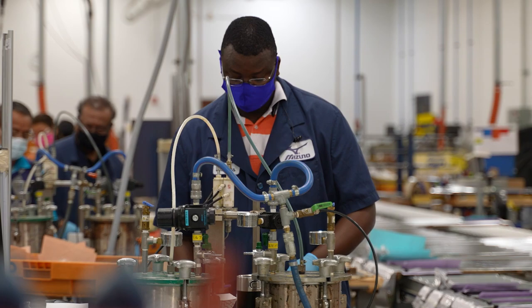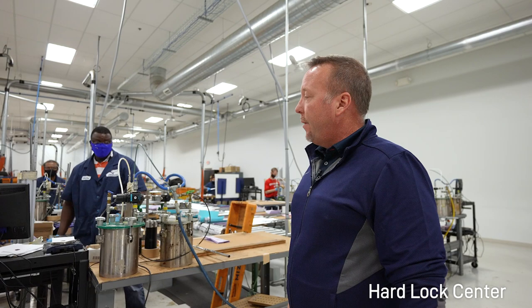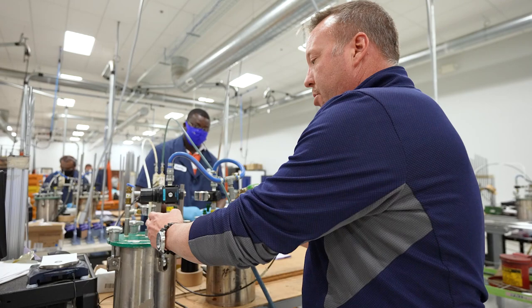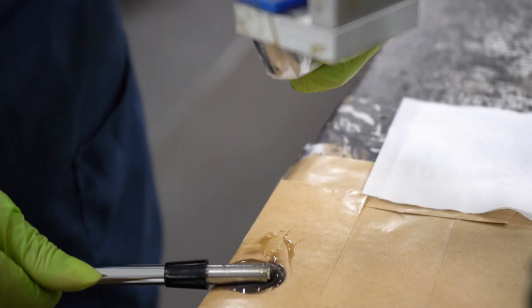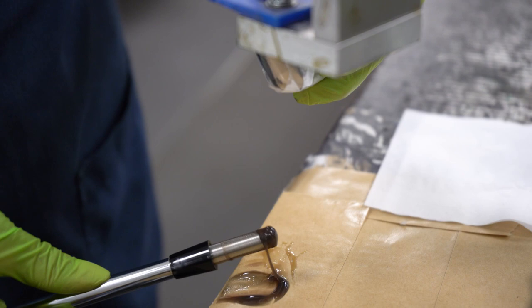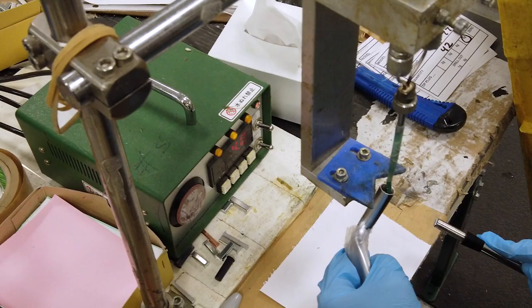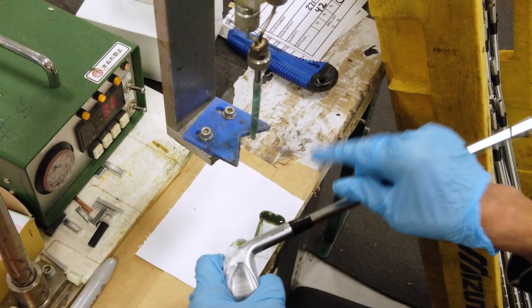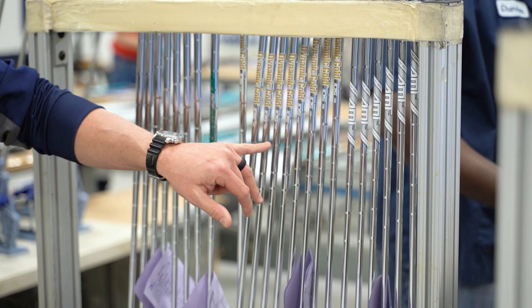Welcome to our Hard Lock Work Center. Charles is in the process of gluing the head and shaft together. This is a proprietary product that only Mizuno has — a two-part epoxy. We've got half a gram coming out of one pot and half a gram out of the other, mixing to one gram off the mixer. He puts glue in the bore, rolls the shaft with glue, and makes sure all logos are lined up correctly behind the golf club so you don't see the logo in playing position. We want to keep the front of the golf club as clean as possible, and we make sure all decals are aligned in the back so the club looks clean at address.